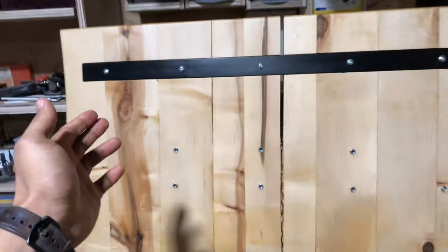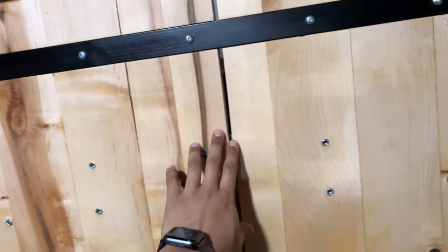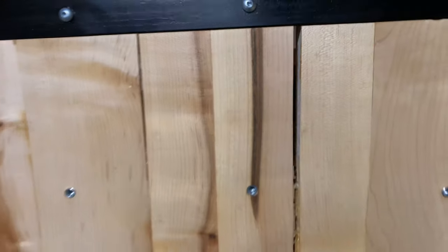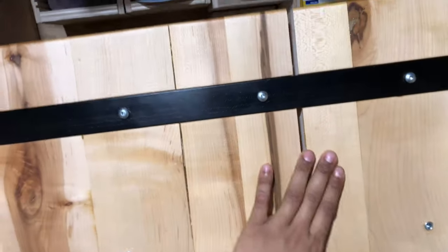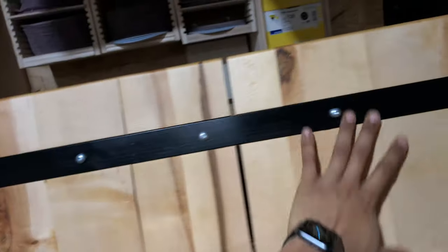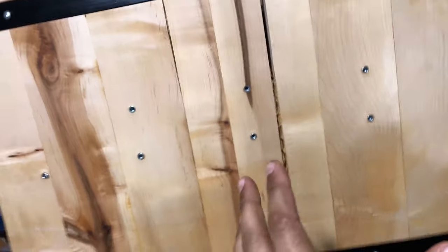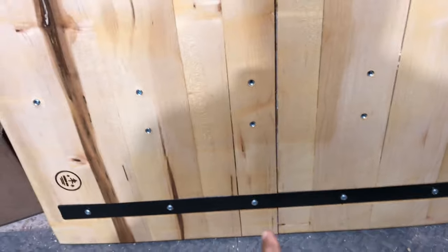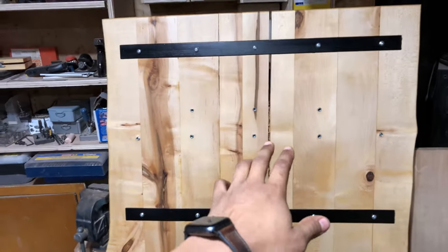So here's the table and here's the crack for reference — it's three-eighths of an inch, almost half an inch on the bigger side, getting a little smaller down at the end. Usually when a table cracks, tension causes the table to contract on one side and expand on the other, kind of banana-peeling open. Initially when I looked at it, I realized the crack here isn't indicative of that type of movement — it cracked right through.